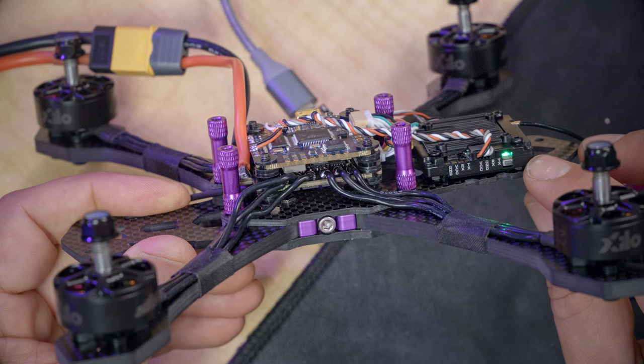Nope, I've flown it. And the first time it crashed, the camera went doink and fell down. So what I've done now is I have moved the screws to the bottom hole of the camera, hoping that will move the fulcrum closer to the center of gravity of the camera and give the camera lens less leverage to pull it down. And I have gone to the second smallest screw. I was on the smallest screw that came with the camera. Now I'm on the second smallest, and I've added two of the washers that the camera comes with, in hopes that will give a little more friction.